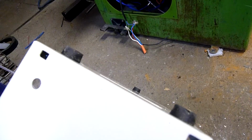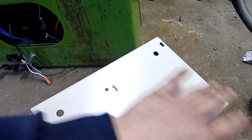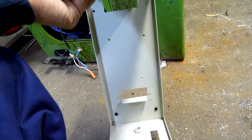That'll keep it away far enough to let air come up through these slots, because the bottom of the heat sink of the drive will be over that slot there, and everything else rising up will come out through there. I'll have a sheet metal splash guard over the top, so if it does get splashed with water it's fine. There's also some perforations in the casing, but not a lot. The amount of time the drive is going to be running will be very minimal.